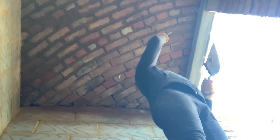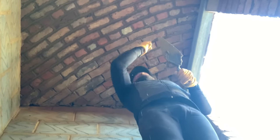Really compressing that mucky. She's good. I said this before, you see a lot of these foreigners, they don't use a former, they use yeso. The particles in that mortar go right up within seconds of using it, so they don't need a former. But you know what we're like here in the UK, we like to do it thoroughly and better. Sand, cement, bricks and mortar is what I require to take this vault wall much higher.